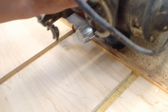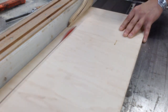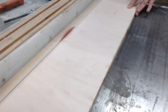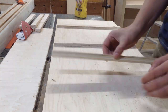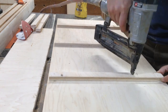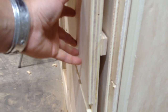I'm bringing this back to the table saw to cut some spacers. The slides I'm using have to be flush with the face frame, and there was about an inch and three-eighths gap off the side. To have this flush in place, I'm gluing some spacers on the back side, and then this carcass I'm making will be permanently screwed into the sides of the cabinet. You can see how those spacers function - I'll put screws through the spacers into the cabinet to hold everything flush, and then I can measure in between and cut for the shelves.